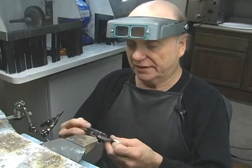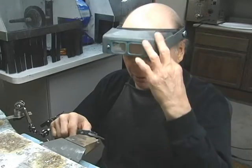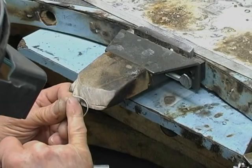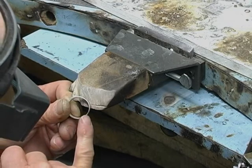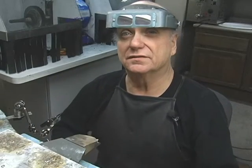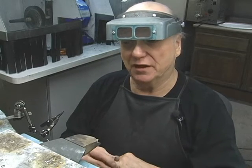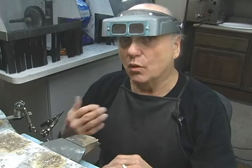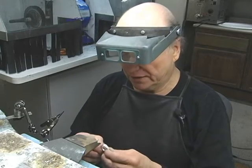This is where your calipers come in very handy. Make sure they're zeroed. Now, I want to look at this ring, and you see right here where it's thicker. And over here, it's pretty thick there. Quite often when someone's wearing a ring, they leave it on all the time, so it's always worn in the same direction. And inevitably, one side of the ring will wear out more than the other side. This one looks fairly even.